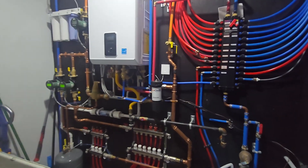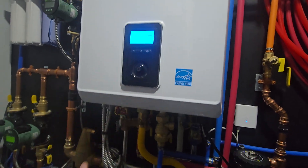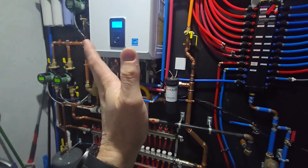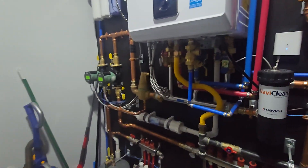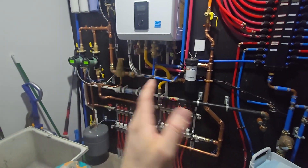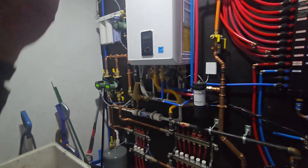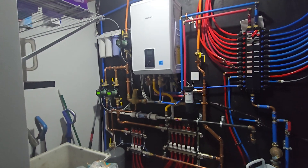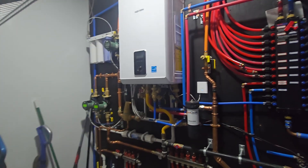So it's expected to be in the range of 12 to 30 psi. If you had a manual pressure gauge on the system, you'd be able to read that when the system's completely cooled down, it's going to match whatever that fill or pressure regulator is set to. The autofill on this unit is set to 12 automatically. If you had a manual one set to 12 and the system cooled down completely, you'd see the gauge drop down to 12. If you were to shut the system off, ideally it would drop back down to that initial setting of 12 psi. At its maximum, the most it will ever push could be 30 before the pressure relief valve goes off.